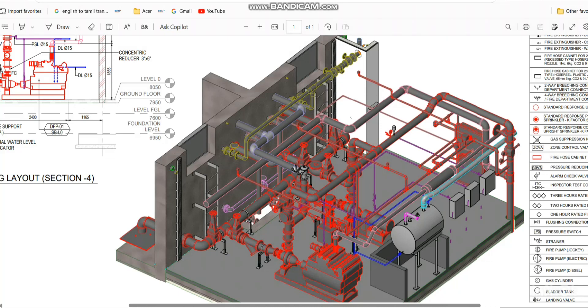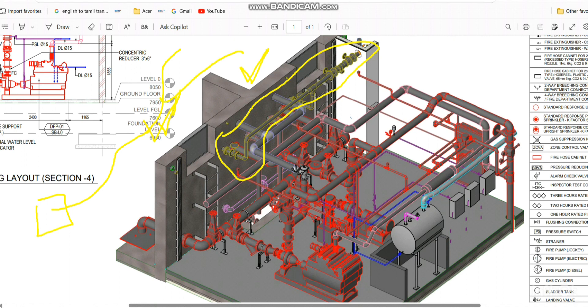Good morning friends. In today's video we are going to see how to size the firefighting tank filling line. In our project you can see there are two firefighting compartments — firefighting tank one and firefighting tank two. Normally a firefighting tank must have two compartments so that if maintenance is happening in one compartment, the other can function. The yellow color line coming from the outside water supply connection, which is the municipality line, goes to the water supply tank, the firefighting tank, and the irrigation tank. After the water meter connection, one line goes to firefighting tank one and, after a reducer, another line goes to the second fire compartment. We are going to see how to size this fire water tank filling line.